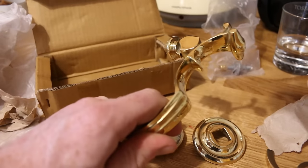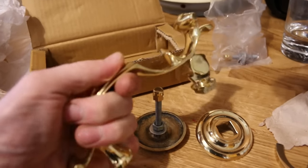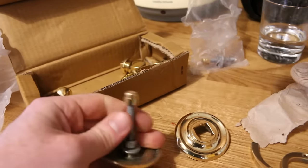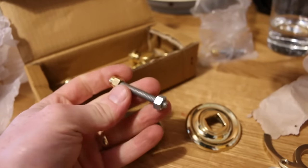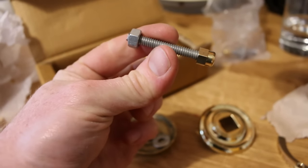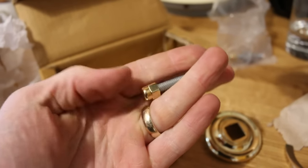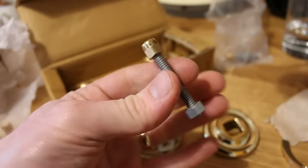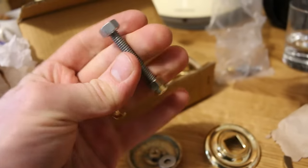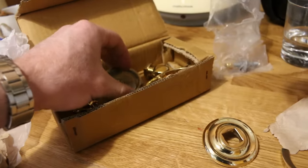I've unpackaged it and it's looking great. It'll weather down a bit like the one in the shop — kind of lose the real shine and look a bit more period-feature style. The little threaded rods that come with it don't have a bolt as such, just a nut each end, and they are not long enough to go through that beefy door. The door is something like 60mm thick and this will only just clear a 45mm wooden door. All I need to do is get a bolt tomorrow, cut the head off it, and use that.